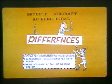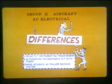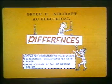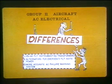There are only a few basic differences between the AC electrical systems in the Group 1 and Group 2 aircraft. Primarily, all flight instruments are operated from 115 volt AC, thereby eliminating the flight instrument step-down transformers and their associated fuses. As the use of vacuum pumps was discontinued, 115 volt AC alternators were installed as a source of emergency flight instrument power. Finally, the inverter warning lights were re-designated as flight instrument warning lights, with associated AC relays made more sensitive to voltage variations.